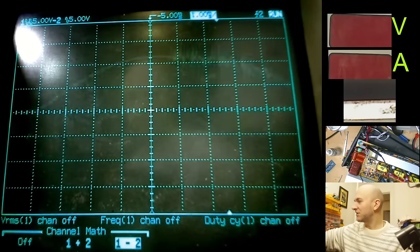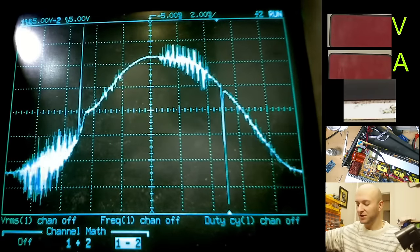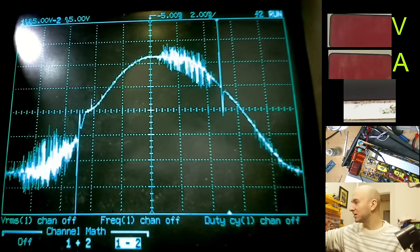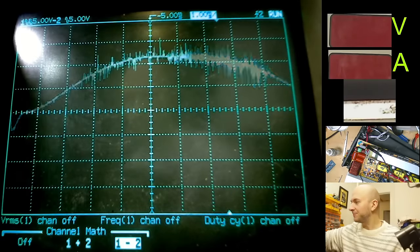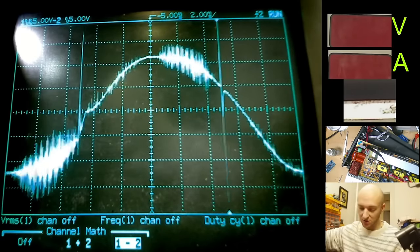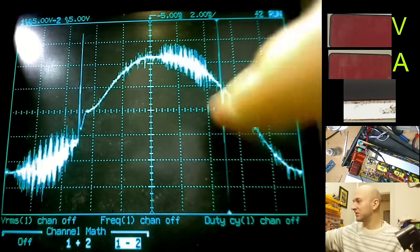That's very, very annoying, because I don't really know whether that's caused by the IGBTs. Well, it's got to be. We've got the original chip fitted and original drivers, so it's just got to be a characteristic of the replacement IGBTs, I reckon. So the circuit's clearly working and we have the correct drives on each bank of IGBTs, high side and low side, for both channels.